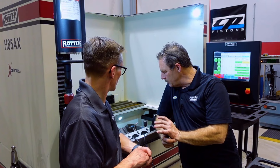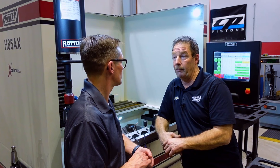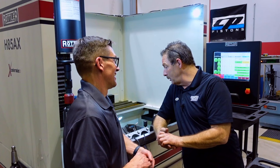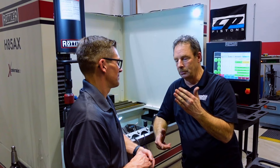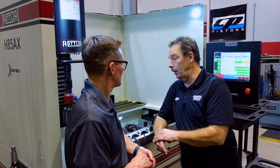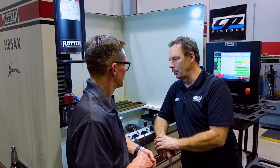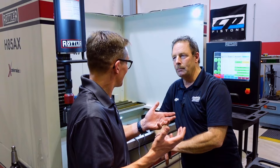What's really stuck out to me is that just like the last block, you told me your father had overheated it at the last race, so we expected to see big variance cylinder to cylinder and expected to have a fight with it. Honestly, whether we did or didn't, this Rottler machine made it look like the motor had hardly ever been run — right up within two to three tenths. There's no job too big for this machine. It has done so much for us here at KB Racing. It can save any block regardless of what condition it's been through, bring it back with a minimum amount of honing — it prolongs the life and brings it back to as good as new.